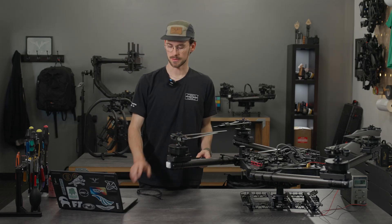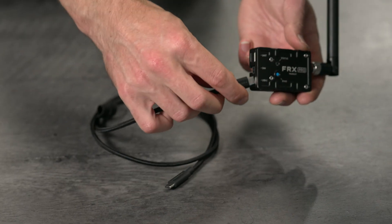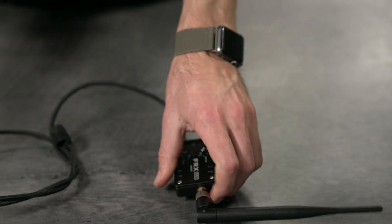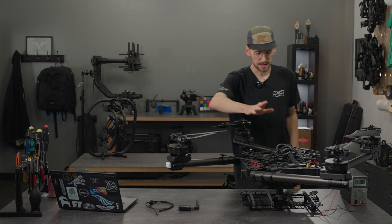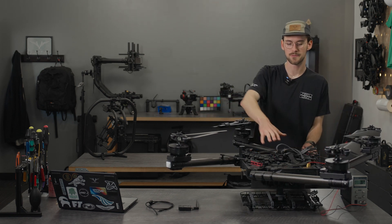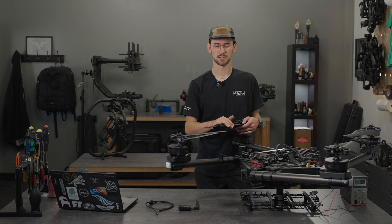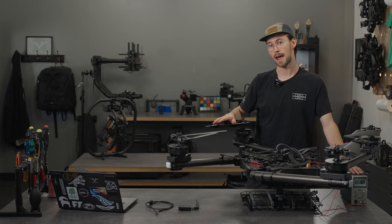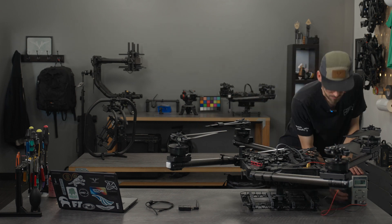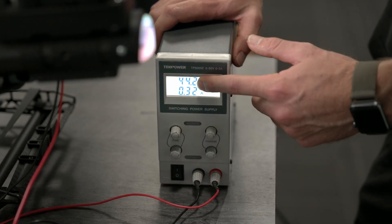For binding your FRX Pro to your laptop using QGroundControl, you'll need the receiving FRX Pro and a USB-C cable — whether it's C to A or C to C, it doesn't matter as long as it matches your laptop. We'll need to provide the aircraft with power somehow. It's important to mention that you should never power on your aircraft with flight packs with the props on on the bench, for safety reasons. Here I'm using a power supply at 44.2 volts and about half an amp so the aircraft wouldn't have enough power to arm. Let's flip that on.